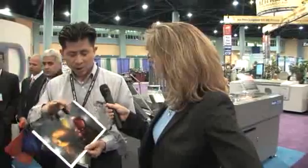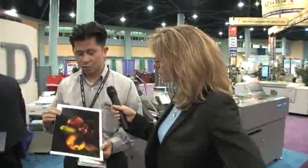As post-press products are harsh to paper substrate, depending on what they are, the UV coating is an extra layer to help protect the image. So what it does is it creates a gloss coating. We can offer a gloss coat, a satin coat, or a matte coat to the product, which enhances the image quality, as well as protects it from post-press devices. In a direct mail type of piece, if you receive direct mail pieces at home where the product's really scratched up, okay? This product is specifically geared towards the direct mail market to protect mailing pieces that post office devices have ruined.